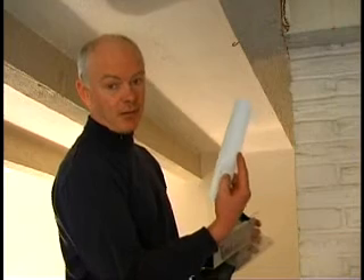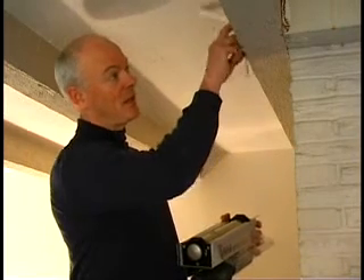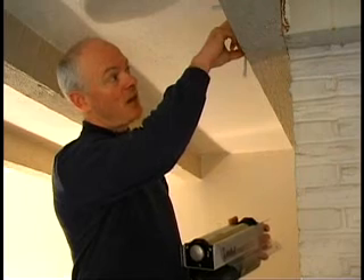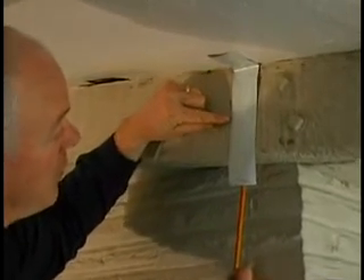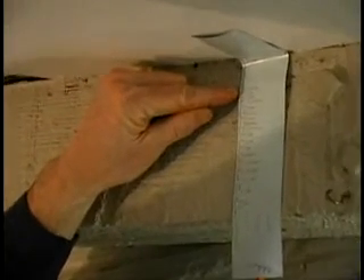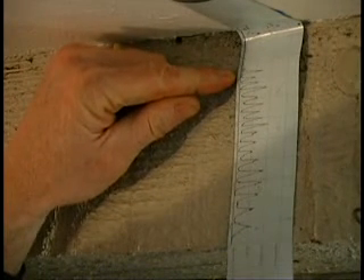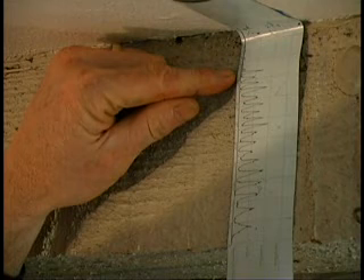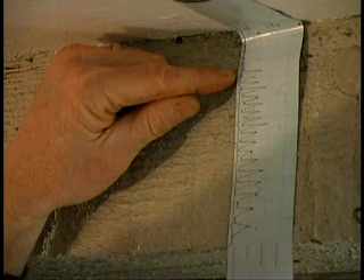Now I've got my wax paper strip here, and I can easily lay it on the beam. I'm looking now and I can see that where I've drilled, this is the normal pattern for sound wood. And then right up near the top of the beam, the resistance drops quickly to zero, indicating decay. I know I had a water leak here, but this information tells me a lot more than I might get by poking around with a screwdriver, or the typical methods that you see used for this kind of investigation.